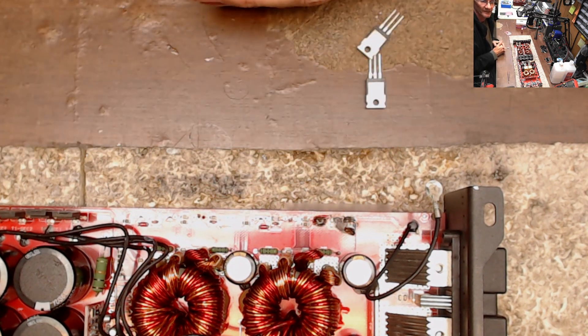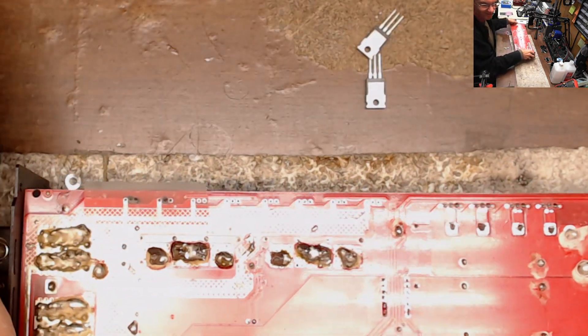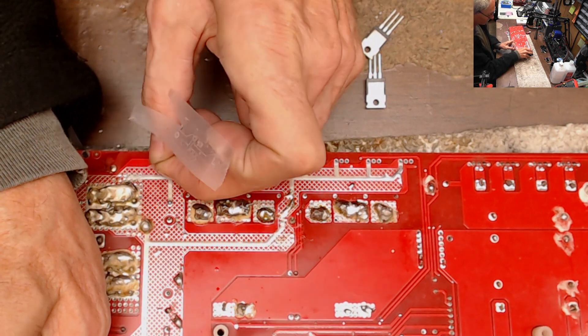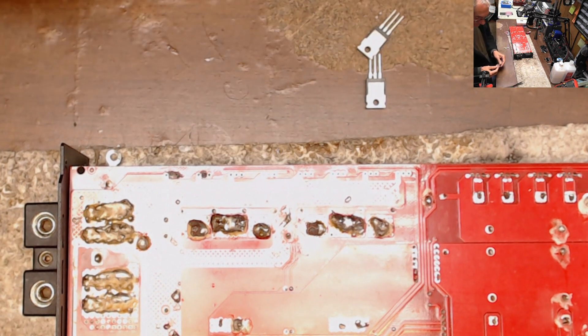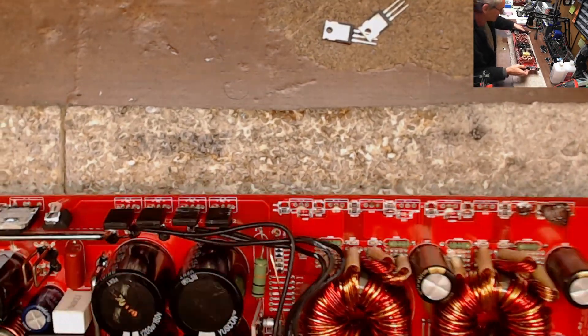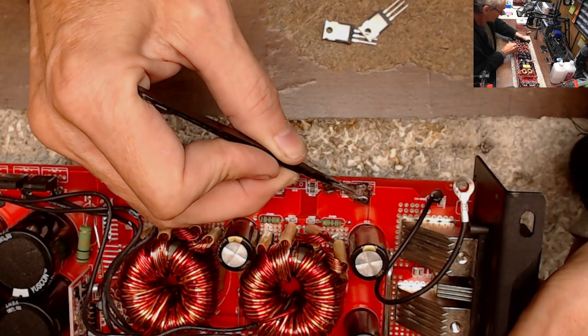That is really the basics of repairing a section of board. Like I said, I had tape underneath — there's that cellophane tape I was talking about — and then you can just peel it right back off the board. Now your resin that you laid out is perfectly flat and level with the board itself. So that is repairing vias on a board, or even traces — it's really repairing pretty much anything when it comes to PCBs. Flat, level, you're ready to go.